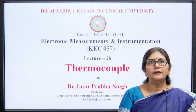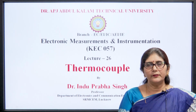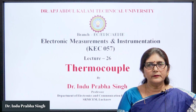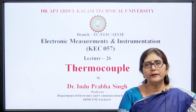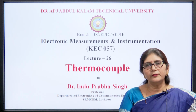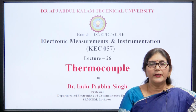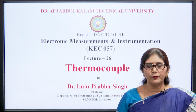Welcome you all to the 26th lecture of Electronic Measurements and Instrumentation. In this lecture, I will discuss a transducer that is known as a thermocouple, and it converts the change in temperature into change in voltage. So, it is an active transducer because we do not need any auxiliary source to get the variation in the change in voltage.